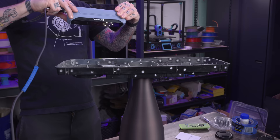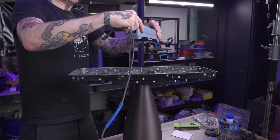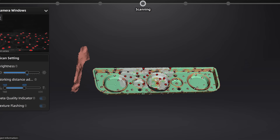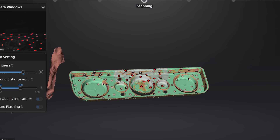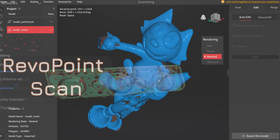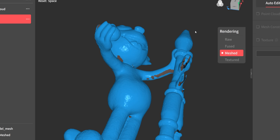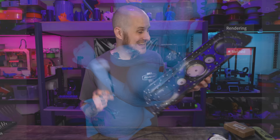I spent way too much time scanning this — that's one thing I probably do wrong with 3D scanning. I just keep going over and over surfaces trying to get every nook and cranny and detail of an object. I didn't really need that for this project, but I wanted to show you folks the detail I could create with this scanner. I will note that Revopoint specifically told me not to over-scan things like that, because that would lead to confusion in the point cloud and fuzzy texture on the outside of my scans. Though I found the EinScan just did a better job handling that overall. With every nook and cranny scanned, I can move on to exporting a file to start working with to design.